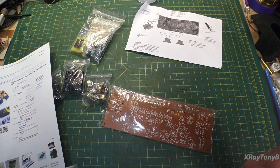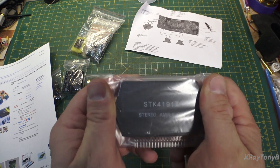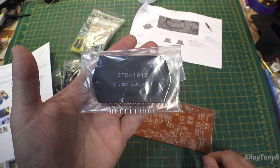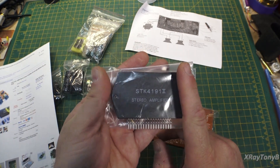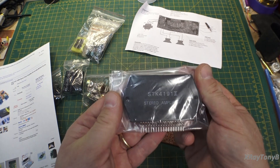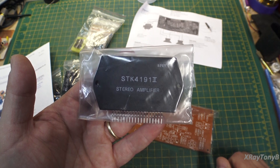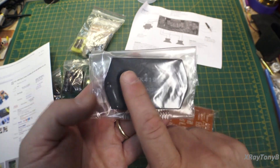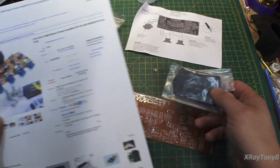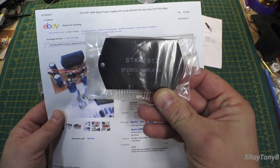Now let's go over the disclaimer. These chips — Sanyo no longer manufactures them. This one here, I can unequivocally tell you, is not made by Sanyo. If it is modern production, it is a reproduction chip, probably not built to the standards of quality of the original Sanyo. That being said, some of these do work very well, some of them do not. You don't know what components are in here, so this chip really could be a 50-watt-per-channel stereo amplifier that performs at that level, or it could be something that's not that good. We will only know after we try it.